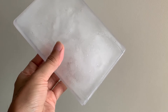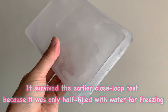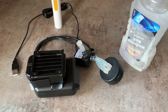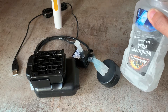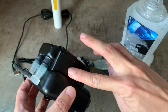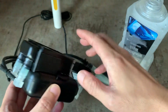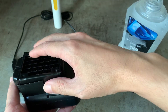Unfortunately, the slim profile plastic bottle is made of hard plastic, so once the water is frozen it cracks the bottle and it can't be used anymore. Here's the final version of the open loop system with a few upgrades. I have replaced the cracked hard plastic reservoir with a flexible one — this is a windshield wash bottle, which you can find in the hardware store. Because this bottle is made of flexible plastic, it's not going to crack. Now all the gaps are sealed up using the plastic template shown earlier, so the fan will be drawing air through the radiator, which will be cold.